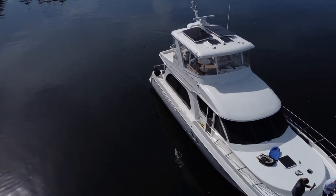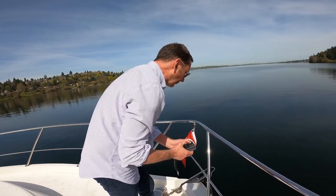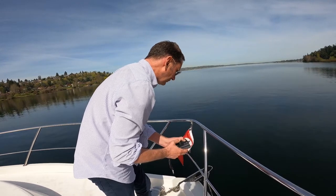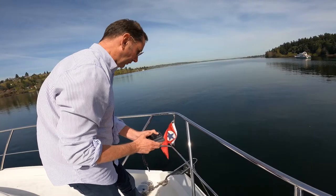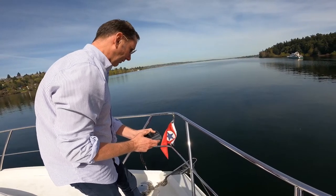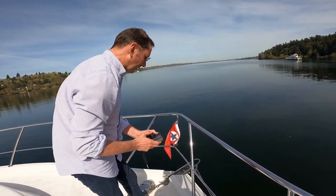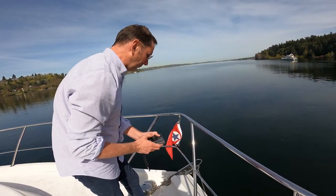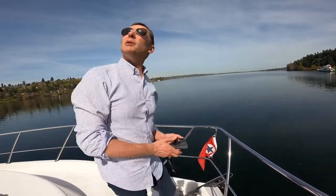Up over our tackle now. So we're coming to more of a stop. So we need to go up and go forward. We're getting really close over tackle here. You can tell. We're getting up over it. You can feel the windlass starting to load. We don't want to overload the windlass. So we are sitting basically on top.